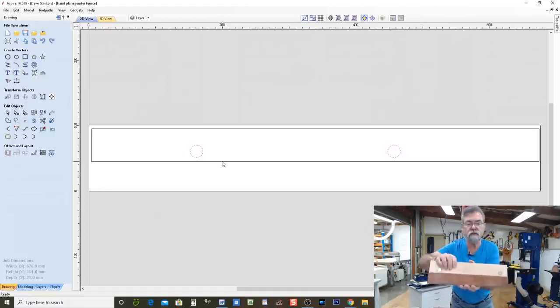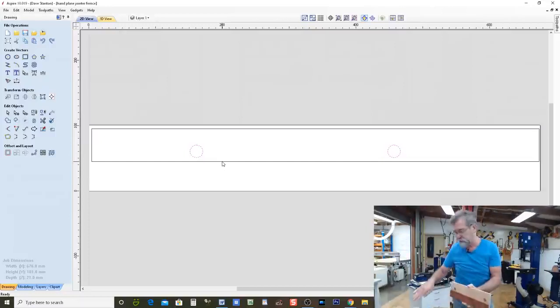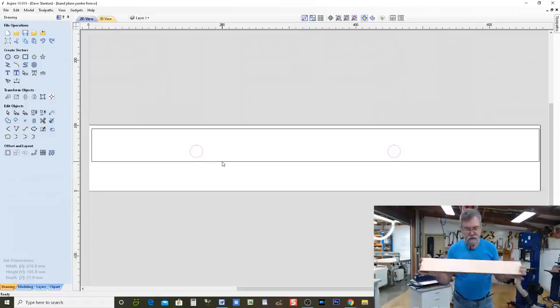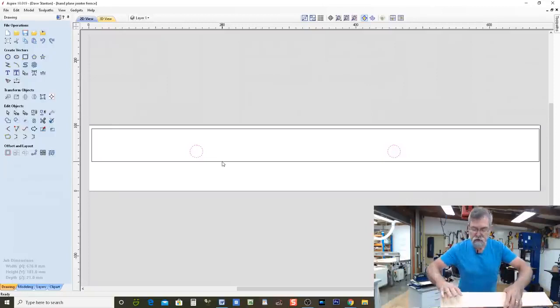Looking at this, the edge of those magnets is 5.9 millimeters down to the step. It works perfectly here, but I've allowed 0.1 of a millimeter in my calculations just to let it sneak up a little bit higher. All of this I can fix a little later if it goes slightly pear-shaped, but it should be okay. Now, those holes, I don't really want to put in the center of this board. I want them to move to the end, like that.